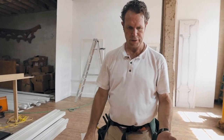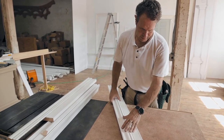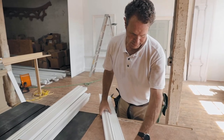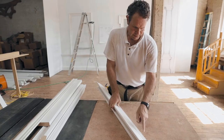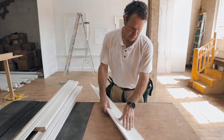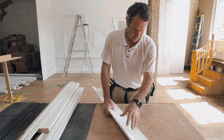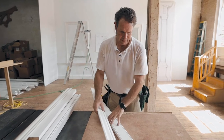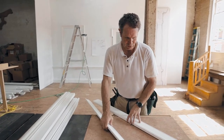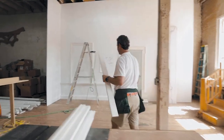For a simple crown, I talked about readability of moldings. I'm setting a regular crown on a beaded casing. I won't put the moldings too close together because you can no longer read them — I'll spread them out so there's a really pretty cyma, then a break, then the bead finishes it. That's how we treat the simple version. You can use a straight crown, but if you want to elevate it a little, you do this combination. This is the first one I'm going to nail up.